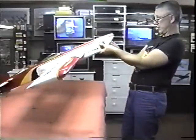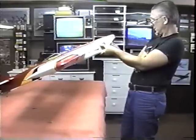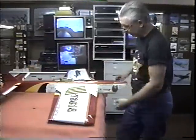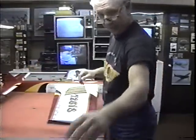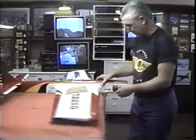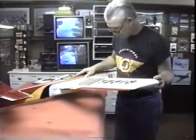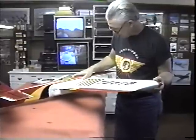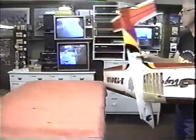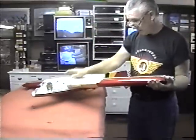Obviously the first thing is to sight it from every possible angle. And to tell you the truth, it looks like we do have just a tad bit of dihedral. But again, I don't think that's going to keep the plane from flying. I've had other planes that, hey, being this is a test plane anyway, or it's going to be Peabody's plane, one or the other. Now I also want to put a little bit of a stress test to see if I can hear or see something cracking here. That feels okay, and obviously you want to do it in both dimensions too. Before you would go ahead and do all this work, it would be a shame if you pushed down and the wing fell off.